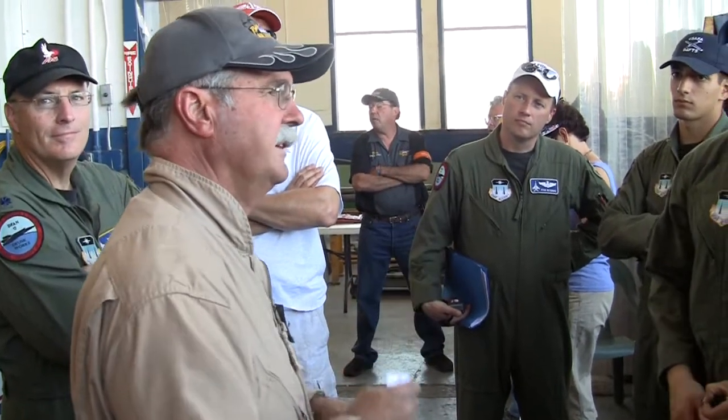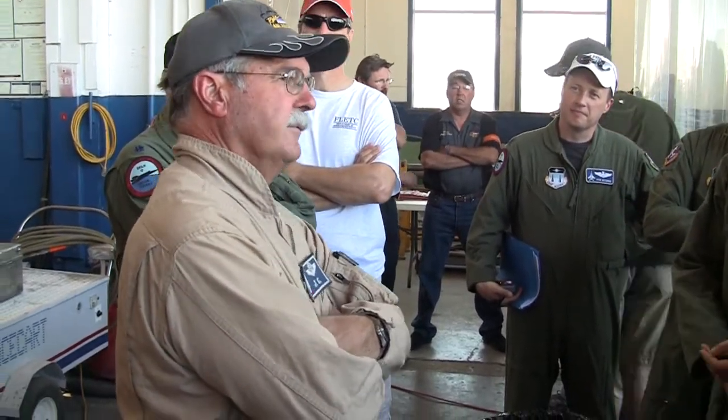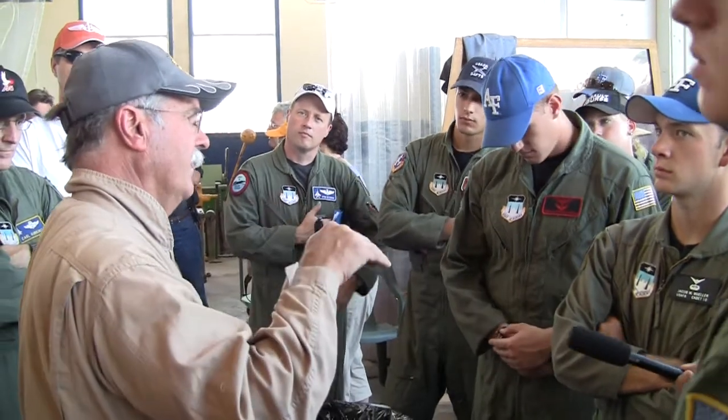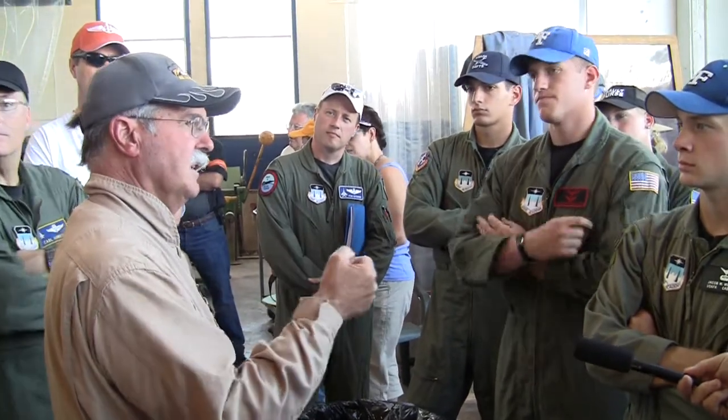So this was all designed to increase our handling qualities for the airplane, and it worked very well. I went up and did a flight test before we put the leading-edge extension on, and I took it right up to the corner — 0.74 Mach and 425 knots indicated, which is the VMO for the airplane. Starting at about 0.68 Mach, we know we started getting some Mach effects there, and I started getting an increase in the stick force per G.